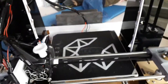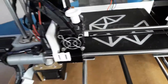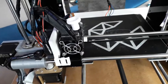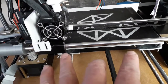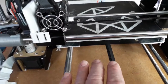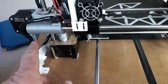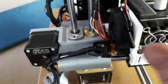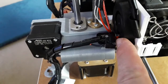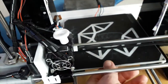You live and learn — if you're going to be messing about changing any of this stuff, turn it off so you don't short anything out. When you level your bed you're only moving the screws a couple of turns, so if you suddenly find it's all the way down, the first thing to check is your stop switches. I've had trouble with that one before. This one here — the screw came out, and when the travel came along it was banging away because it couldn't switch itself off. So your safety checks when you haven't used it for a while: check that one, that one, and the one at the back to make sure they're all connected properly.